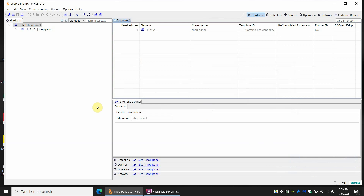Now your panel should be automatically rebooting. At some point it's going to ask you about installing a BVD. A BVD is a version of a license — you may have one or multiple depending on which company you're with. Install the proper one. But there's some work we have to do here. If we went from, say, version 8 to version 9, you could not just stick this program back on the panel — it will not work. You'll get an error message saying Incompatible BVD.